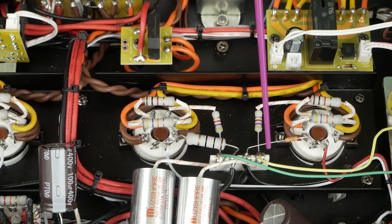Whereas if you had a 5 or 10% resistor — I think these are 5% — you're not going to get the accuracy in biasing. And these are easy to replace. Honestly, if you don't want to do the other stuff we did to this amp, this is something I would recommend doing if you do nothing else.